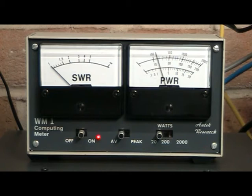What we're looking at here on the meter is an ordinary inline watt meter that's not set to read PEP or peak. As you'll see, as I'm talking — talking it up as I would say — to somewhere around 10 watts, it's often hovering at 5, occasionally it peaks over 10, but it's being talked up to 10 watts in the vernacular.